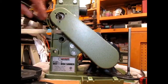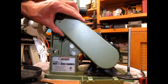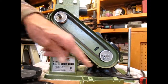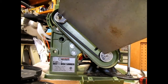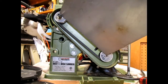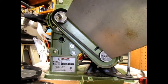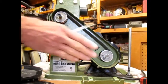The belt cover has four screws and comes right off. Once you adjust your belt, you need to check that the pulleys are parallel and flat to each other. You need something flat — it's only ten and a half inches inside the cover so you can't use a ruler, but use whatever flat object you have. Make sure these are perfectly parallel to each other.